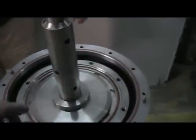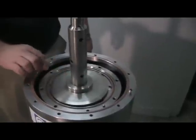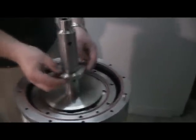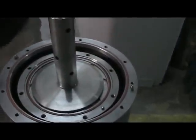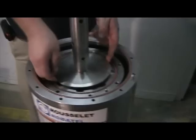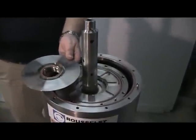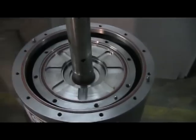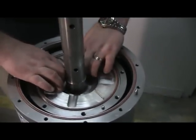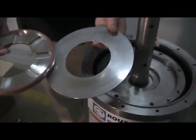What we see is the spacer, which adjusts the height of the internal components. Now we see the heavy phase discharge turbine. It can come off in one piece or two — it's actually two pieces. The next item is the entraining plate. Each item is separated from the adjacent stage with Teflon encapsulated O-rings.